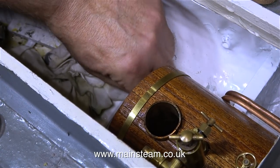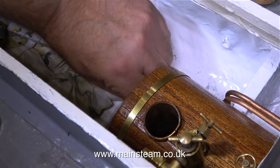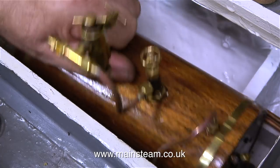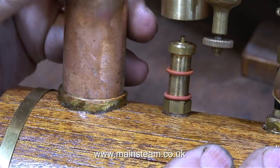It's a simple yet clever design. The hand pump sits on top of the water chest which is really part of the crankshaft driven pump. I did notice that when the engine was running under its own steam, some water was leaking from around the top of the hand pump. I'll fix that in a while.